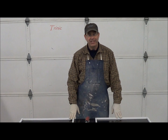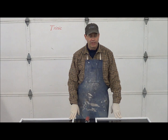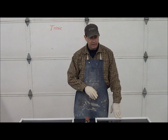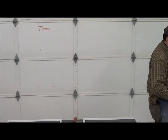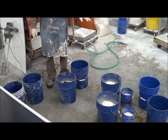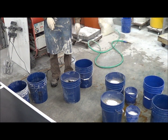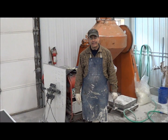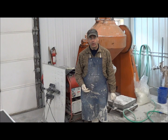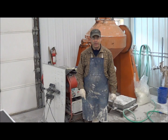This is our fast-setting mix, so within about 15 minutes we're going to mix up an SCC back coat, coat these panels, and then within two hours you can actually strip the product. The first thing you do with a fast set is get everything ready: face coat, water weighed out, back coat, water weighed out for the back coat, mixers ready. At 60 degrees you probably have about 15 minutes working time. If you need longer working time, replace some of the water by weight with ice. In summertime you can replace almost all the water with ice — just make sure it's mixed thoroughly.